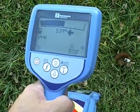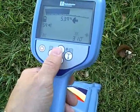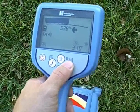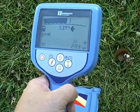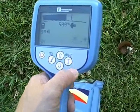On the face of the receiver, you'll have an on-off key, a frequency key, up-down arrows to select your sensitivity level, and a depth key. The depth key switches you between an automated depth reading or a current reading, which displays on the screen all the time, as long as you are over your target line.